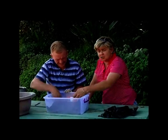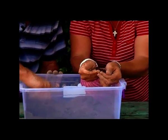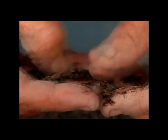The important thing to look out for when you are mixing is that you get rid of all the little clumps. Because if you don't get rid of them, the cement is not getting in there and it's not going to bind properly. This does take a little time but it's well worth it.